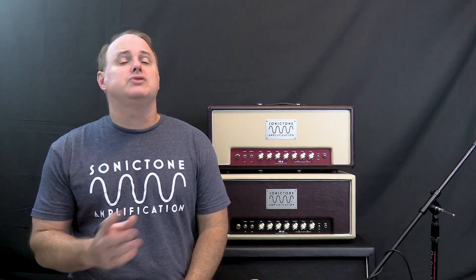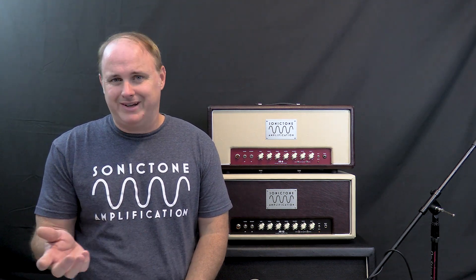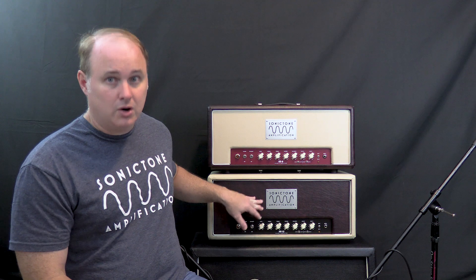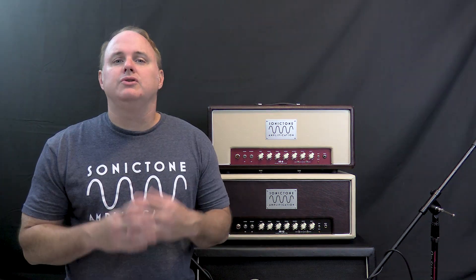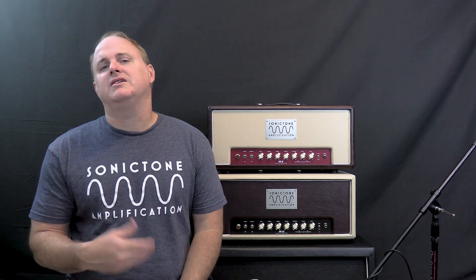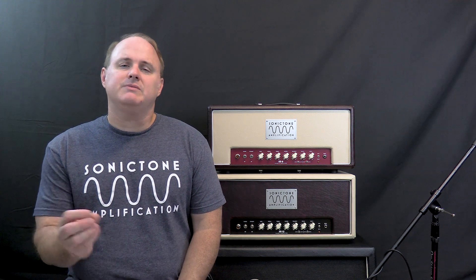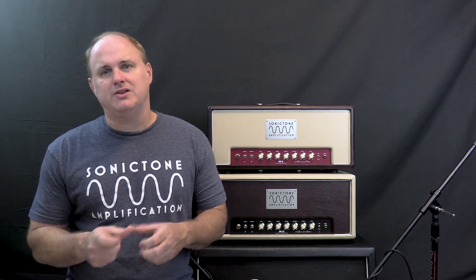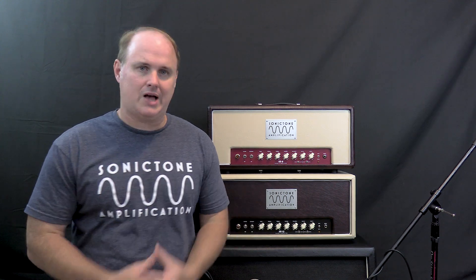The advantages of Class AB is that it's a more efficient topology that allows you to get higher power output out of your amps. The output transformer is a little smaller watt-for-watt. For example, the Delta Jr. is a 15-watt AB amp, and its transformer is a bit smaller than the transformer in this amp here, which is about a 12–15-watt amp. Also, due to the output section design and the output transformer, there's the added benefit of power supply hum cancellation, and crossover distortion is significantly minimized. On the downside, there isn't as much emphasis on even-order harmonics or asymmetrical clipping like Class A, and the dynamics and touch and response do feel a little more stiff and sterile in comparison.